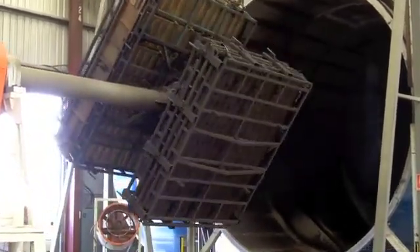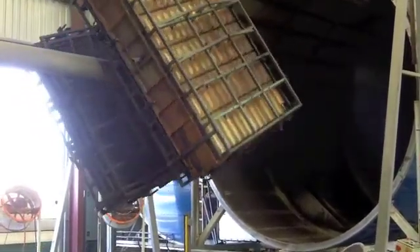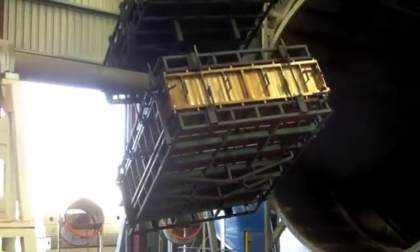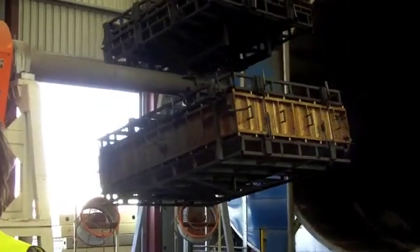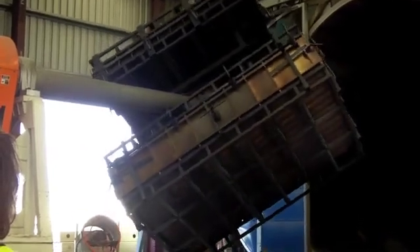The tanks when in the oven are rotated both on the X and Y axis, and this assists in getting the polyethylene powder, which is now in liquid form, to line the mold evenly. You can see this movement of the molds on the arm as they are being removed from the oven.